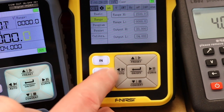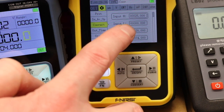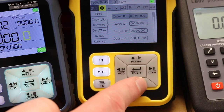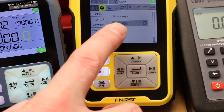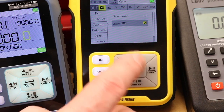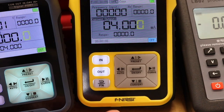In the main settings, going to the convert function: the input of 0 to 25 Hz is set equivalent to an output of 4 to 20 milliamps. To switch on converter mode you go to auto run, set it to a tick, come back out of the menu, then switch the unit off and back on again.